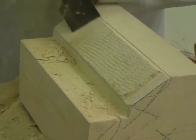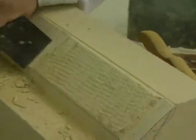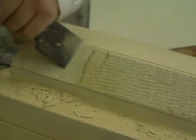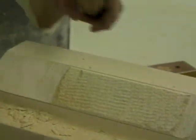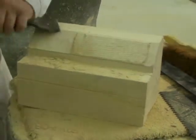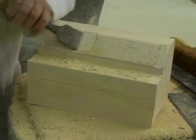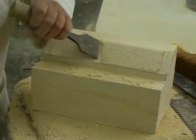Notice what I'm doing: go along for a few taps of the chisel, take a bit of the waste off, and then I'll come back and go over what I've done a little bit finer, taking the last little bit off, and then hopefully when I'm ready to drag it up, I won't have too much to drag off because it'll be down to the line where it needs to be. Just tore this off, and then we better stop for lunch, and then I'll come back to it after lunch.